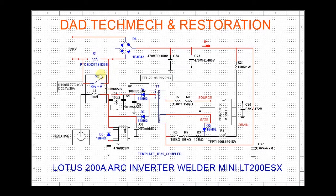So this is our relay. When the relay activates — it's actually 24 volts, though I measured 25, which is okay — when it activates, look at the switch: it will close. And once it closes, the function is to eliminate or bypass this PTC. The PTC is used and bypassed when the relay closes.